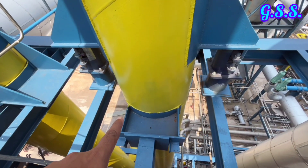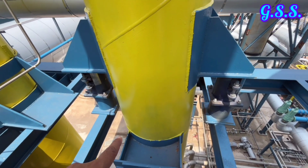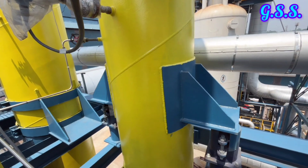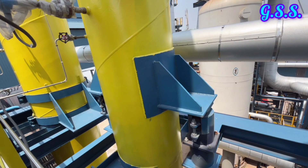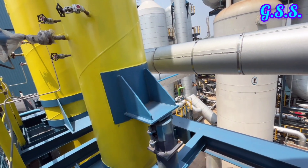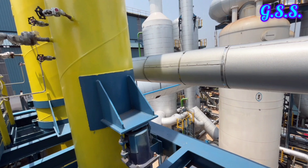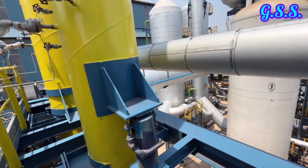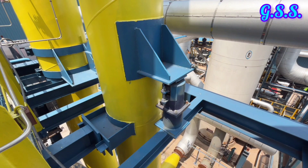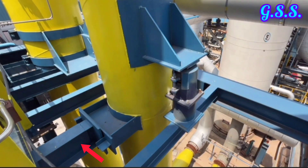This is a welded bracket support for a vertical pipeline with double spring and guide in all directions at zero gap. In pipe stress analysis, input for this support will be spring equals to two numbers, and restrain R equals to X and restrain R equals to Z. This is the guide member in X direction and this is the guide member in Z direction.